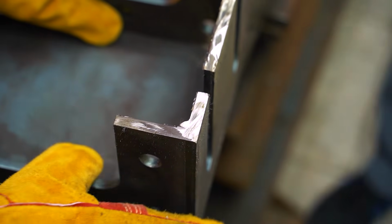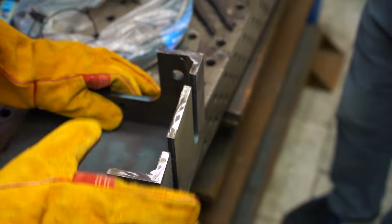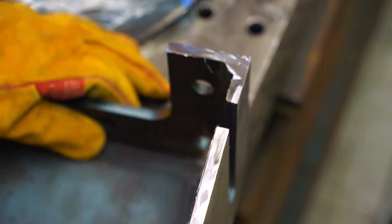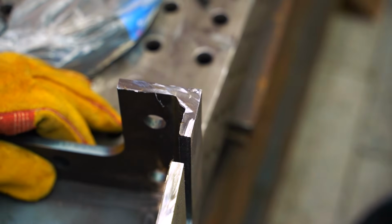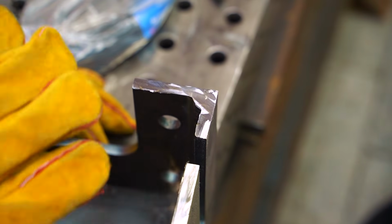So we see here that we will need to do some more exercise, because during our cutting, we don't actually see the exact penetration shape. So we will need to do some polishing on top of that. There's a lot of penetration here, and there's not that much there, but we cannot see this at the moment because of the cutting. So we will need to do polishing, and only after that we will see that. Let's do the polishing.